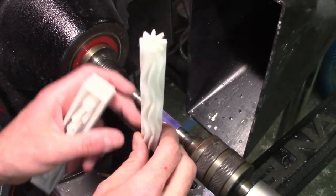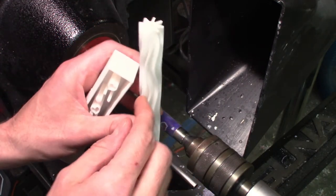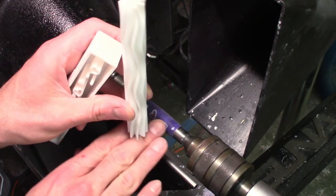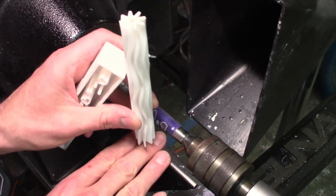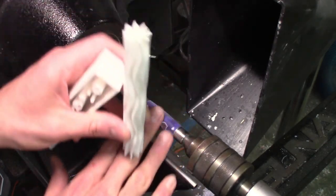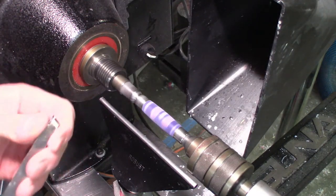The only issue is the way that resin printers work. It's very difficult to explain if you don't know how they operate, but basically you have to peel everything off of this plastic sheet. It half cures it to that and also cures it up to either the material or the bed. So having a lot of flat surfaces can cause some difficulties in printing. That's why people print on angles, or one of the reasons. But like I said, I've been able to just print everything vertically, in normal orientation, without any issues at all.